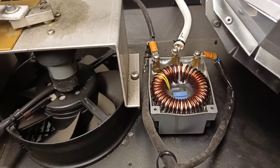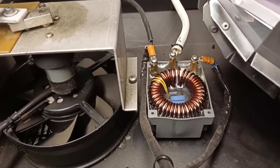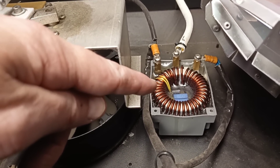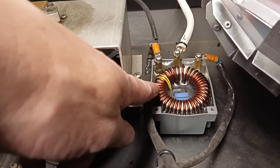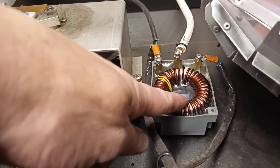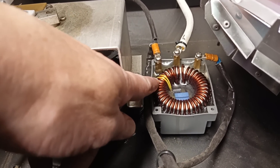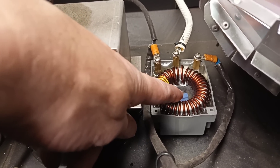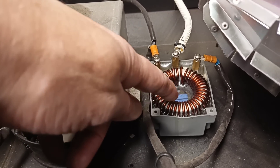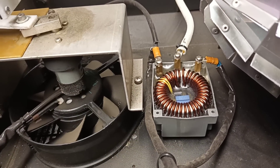The module down there is a high-voltage igniter. The base has traditional ballasts and capacitors. This unit is in line with the lamp and injects a high-voltage spike onto it. The windings in this toroidal core are the main current windings feeding the lamp, where the current passes through. It's a transformer with a couple of turns around it and capacitors, and when this unit triggers it dumps capacitors through these two bits of yellow wire, inducing a high-voltage spike onto the transformer.